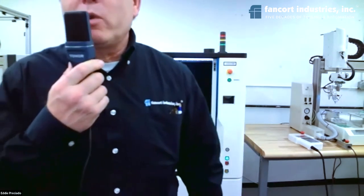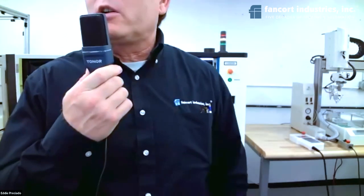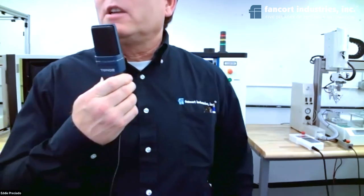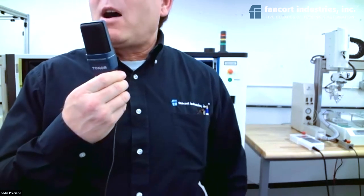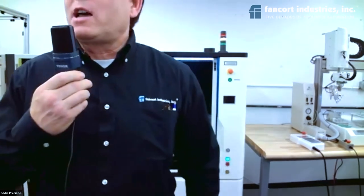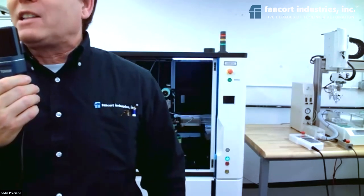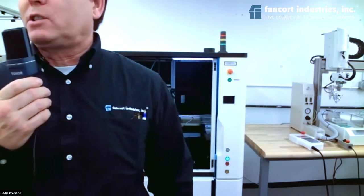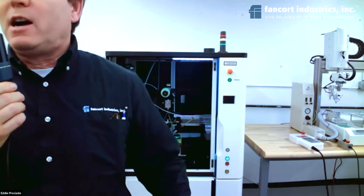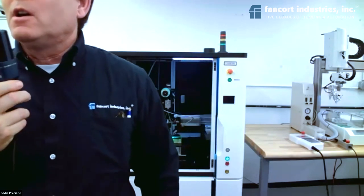Okay, thank you, Ken. We have another question from MS. Does a lot larger field, 100 millimeter versus 60 millimeter, take longer to process? Does it reduce available power per square millimeter? Based on the area laser soldering technology at this point, a larger field of that size, 100 millimeters, even down to 60 millimeters, would take multiple shots in order to solder those different areas.